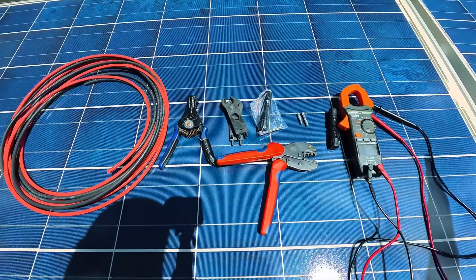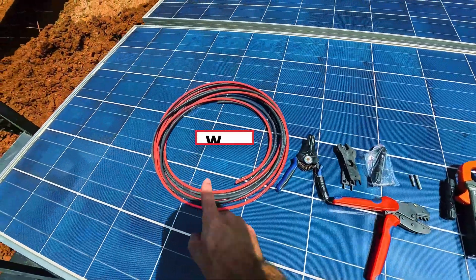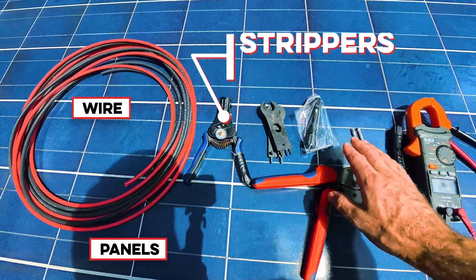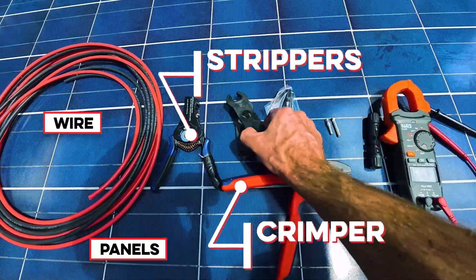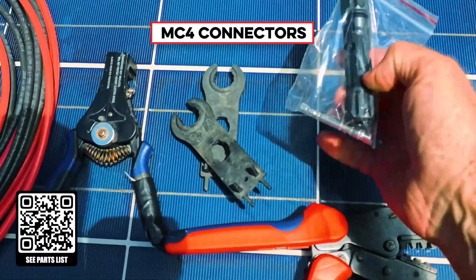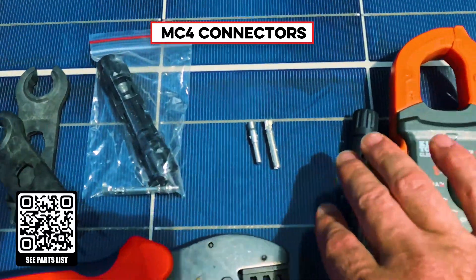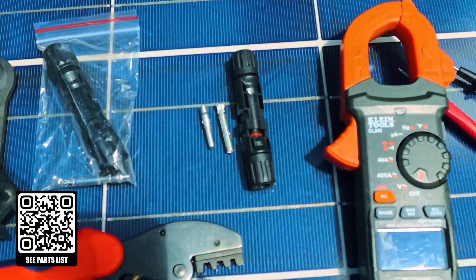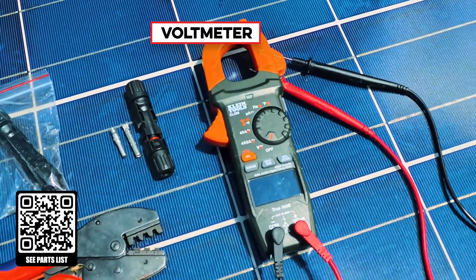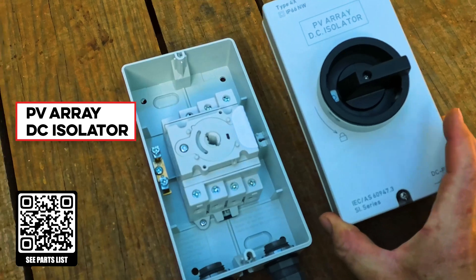This is everything that you're going to need. You're also going to need the mini split, but that's behind us and that's kind of obvious. We're going to need some wire and we're going to need the panels, of course, and we're going to need some strippers. We're going to need a crimper. You don't have to have this, but it's nice to have the MC4 connections and the MC4 connectors that come with the unit — a male and a female — and then one more to go on the other end. And of course you're going to need a voltmeter to test and make sure you're not over voltage on your panels. And the last thing you're going to need is a PV array DC isolator.